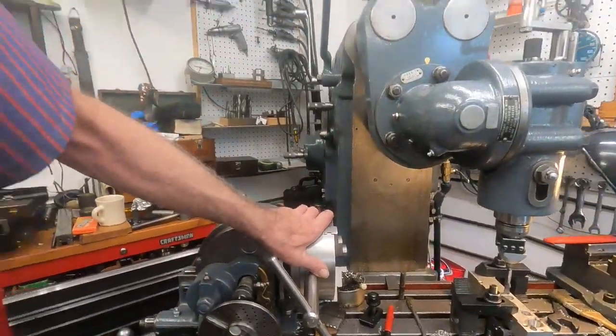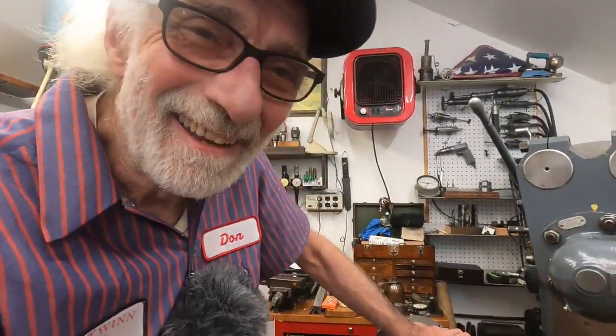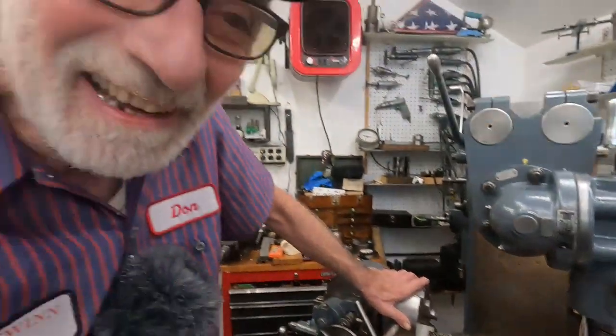Now, like I said, I'm an inside machinist, and my ultimate cheat is that Sunnen honing machine. And I'm going to do a lot more on that. That's kind of a neat little item and a good arrow to have in the quiver. I'm going to go ahead and load this, and I'm going to give up hitting tenths on this old machine, but I'm pretty sure I can hit 5/10ths just using the regular dials on the head.